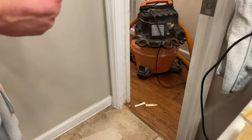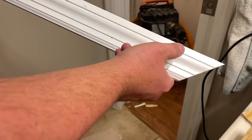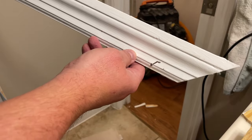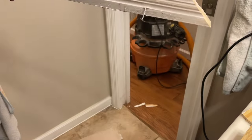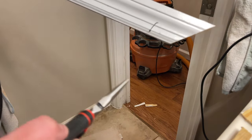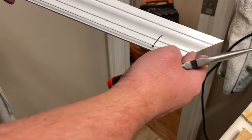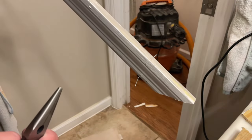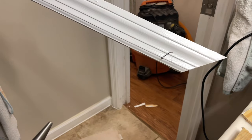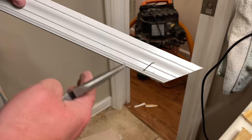As opposed to trying to bang these nails in, which works sometimes, especially into sheetrock, but I'm pretty much hitting wood with all four. And I'm gonna fight these coming out. So what I really wanna do, especially because I cut this access out, is make it easy to remove this in the future. And what I'm gonna do is just caulk it into place at the edges and across the top line, so it's very easy to remove with a razor blade in the future if I need to make an adjustment. Then I don't have to deconstruct things and re-nail it over and over again.